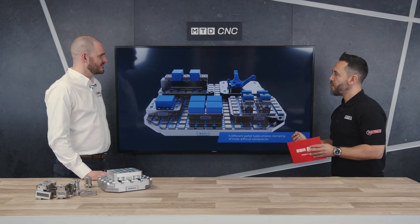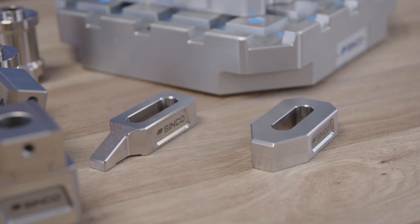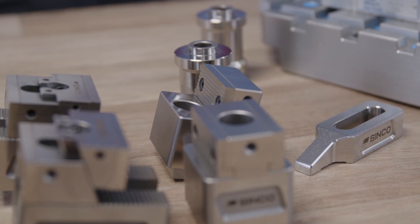It's a very modular system. Let's start off with three-axis applications and the solutions you offer a machinist on a three-axis machine. You can put your vices on it, use conventional workholding on top of your base plate. It also gives you the ability to use a pallet system for quick-change processing — so you can unload your finished workpiece, reload another pallet, and set it going whilst that pallet is being offloaded outside of the machine. When you talk about zero point, are you referring to the zero point on the gridded base plate? Yes.